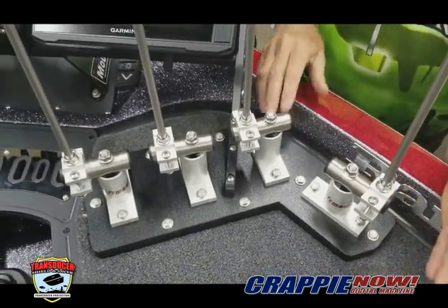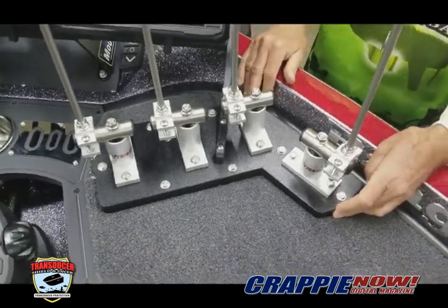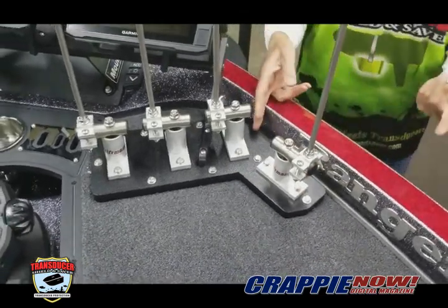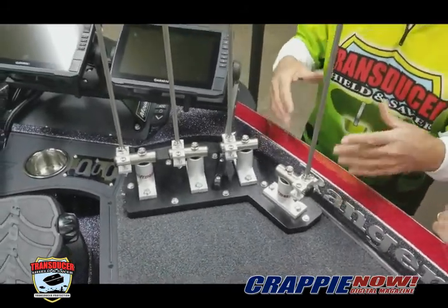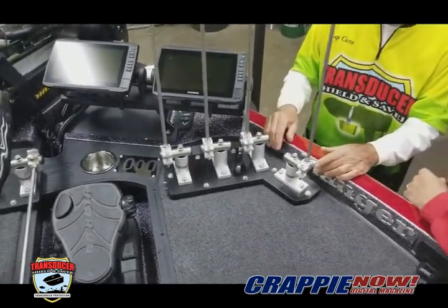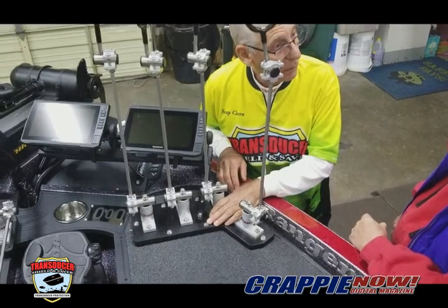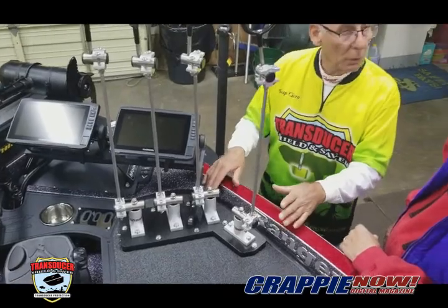On this particular item, I've used a 1-inch polyethylene, pretty strong. Starboard, and all these holders have a stainless steel T-nut. So these screws, you can actually take them out and leave the boards in place, or if you go to service it for a reason or another. So it's really a very valuable way to rig these mounts. So 1-inch starboard, T-nuts on the bottom, and these are the lag screws. Stainless, everything is all stainless. And so it gives you the ability to do all other things to it.